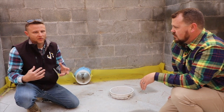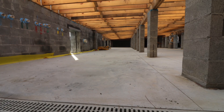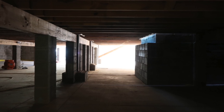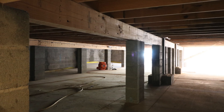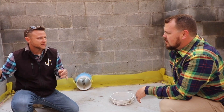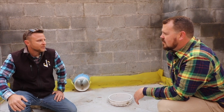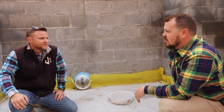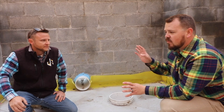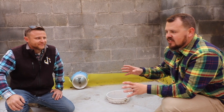One of the coolest things was when we were laying out the crawl space with our plumber, deciding where drain locations should go. In the past we'd intersperse drains throughout, but we had a natural slope on the site and our plumber suggested just pitching the whole slab one direction and having one run of drains. That saves time figuring out where 15 different drains might need to go. The plumber saw the slope and grade and said, 'Why are we fighting that? Why don't we just let it be and pour on top of it?'